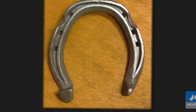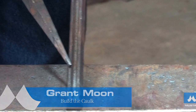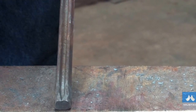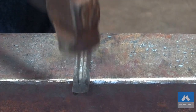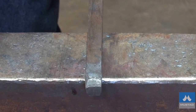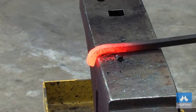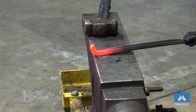When I come out of the fire next, I'm going to do the same thing as I did to the inside. I'm going to fold the concave over from zero just behind the quarters, folding the concave to the center of the heel cork. I visualize where the heel cork is and fold it to that point. Then I'm going to put the heel cork over the edge of the anvil and set it just about an eighth of an inch — about three millimeters — right half on and half off the anvil, just to put a little check in the back so it will make it easier for the heel cork to bend. Half on, half off the anvil — just check it, turn it over, and bend up your heel cork. Make sure we get a nice right angle. Now we've got a good solid piece of metal to make my heel cork from.